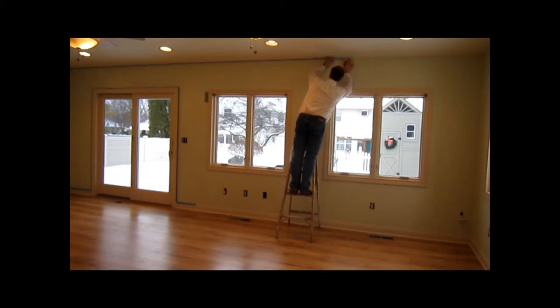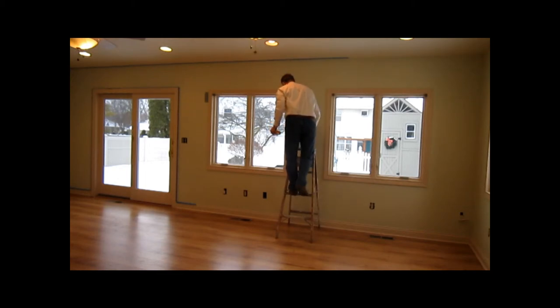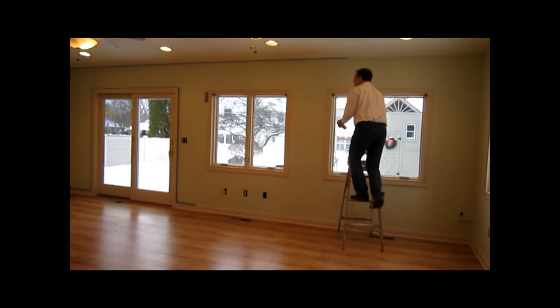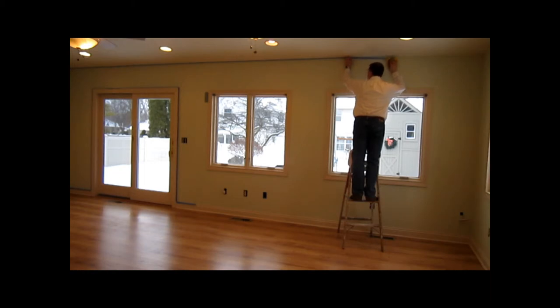You only have a little bit of weight in it. Nothing's done perfectly straight, so I think it's easier to eye it. Using one-inch tape, you can get around those little imperfections between the ceiling and the wall. I like to just hold the masking tool up against the wall and it pretty much will lay where you want the tape to be, except for those little imperfections.